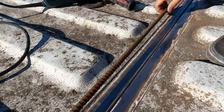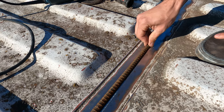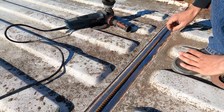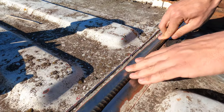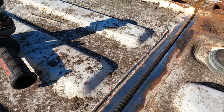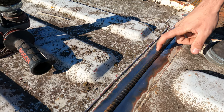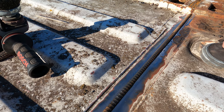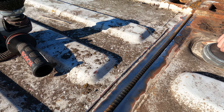This is the piece of rebar we're going to use to close this gap, because it's too wide to weld on its own. So we're going to lay that in there and I'm going to get a couple of tack welds on it, then wire wheel off the rebar. I already tested that a little bit over here — you can see it's shiny. Once that's nice and clean, I can run a weld bead on this side and a weld bead on the other side. That'll really seal things up nicely. Essentially we're using the weld and the rebar to create a seal between the containers so we don't have to worry about waterproofing.